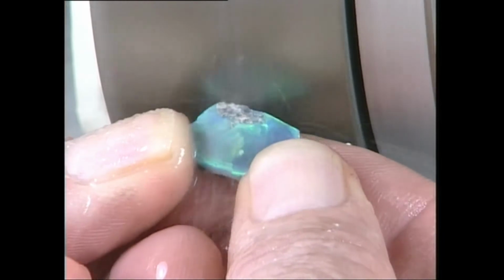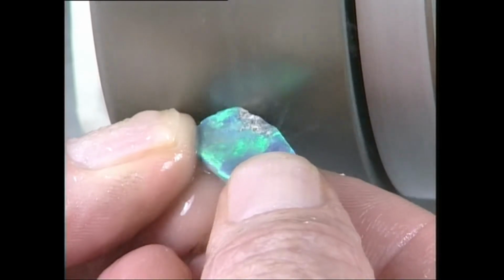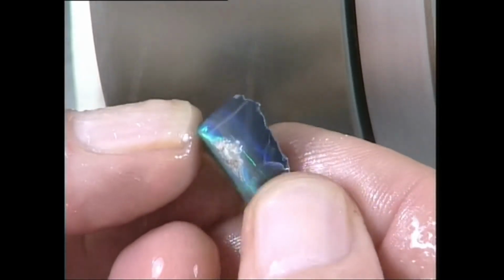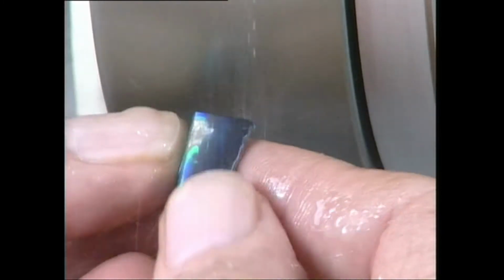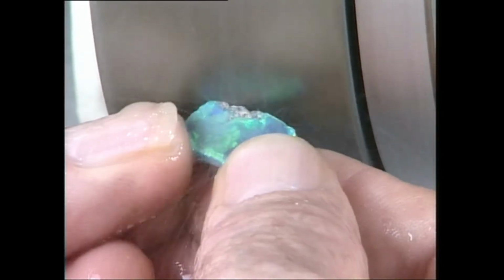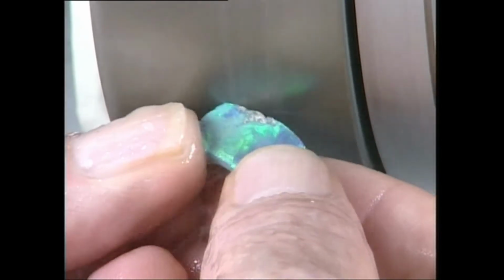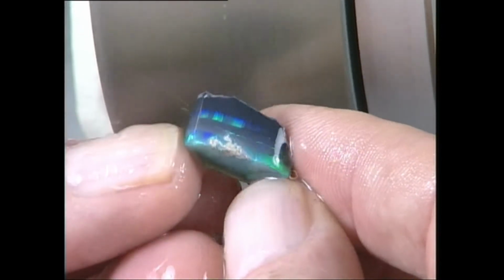While we're doing this, we're working a shape that you have in mind, and always sticking to that as you go. Don't just grind in to get rid of the sand, you work it out within the shape. Just keep bringing it in a little bit at a time until the sand is above the colour bar or up near the top of the colour bar, so you can see your way clear, as I said before, to roll it out during the doming. Just bringing it in slowly, evenly and gently.